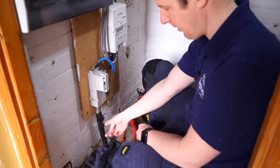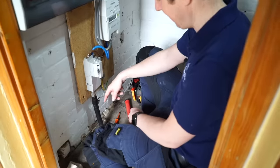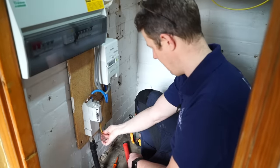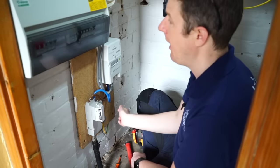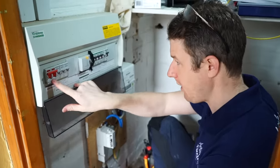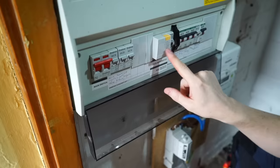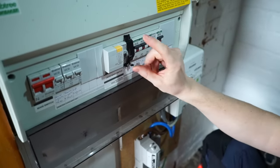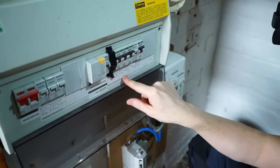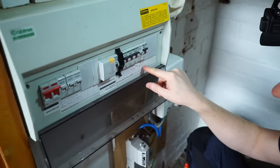It's a TNS system, so you've got this earth cable which comes off the sheath — it's one of those old lead supply cables, quite ancient, wrapped in oil tape insulation. This is the main earthing conductor, and from there you've got a main earth going up to the consumer unit. It feels like it's 10mm, so we'll replace it with 16mm. The bonding conductors are already in place. Currently we've got a main switch and circuits for downstairs lights, rear downstairs lights, front upstairs lights, then an RCD protecting the cooker, downstairs ring, kitchen ring, upstairs ring, immersion heater, and an old tumble dryer point in the garage.